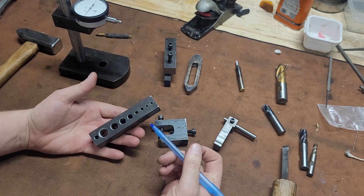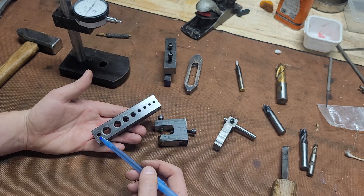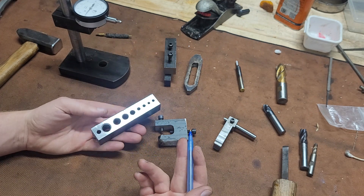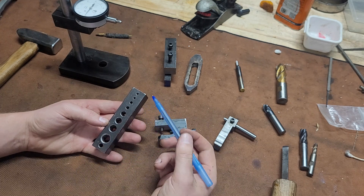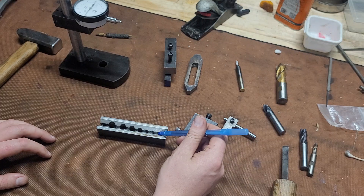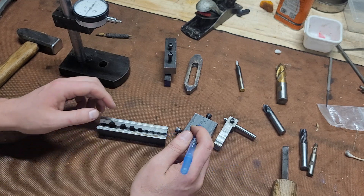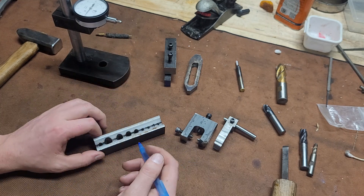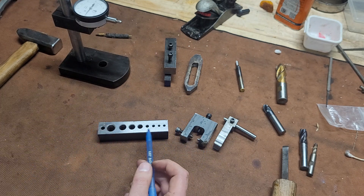You're not going to be making super complex parts. This is a really good beginner's tool — a tap guide — where we have a series of holes. I made this recently because I needed it; I forgot to put a hole in series, so I just went back and popped it on the end. Not a big deal. Mistakes happen, and this is a handy little tool. I think this would be a really fun beginner's project. You make these in mild steel — just square the top, drill all your holes, and mill down the center with about a 3/16ths end mill so you're not cutting on the point of your 90-degree tool. A two-flute 90-degree tool isn't going to ever get a great surface finish, so you've got to be realistic with that — you're not going to get a ground-looking finish.